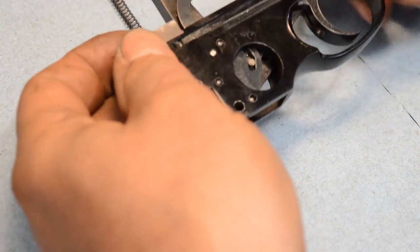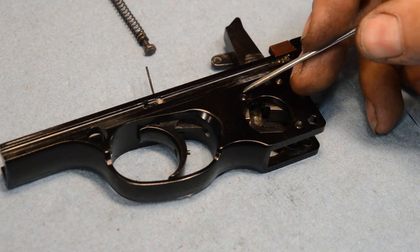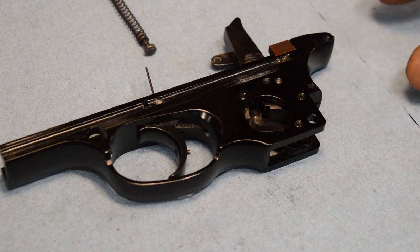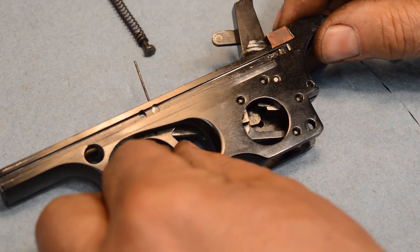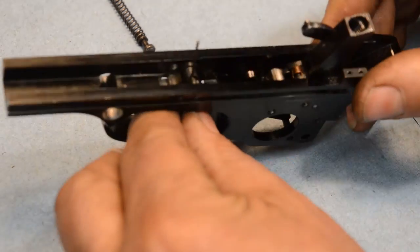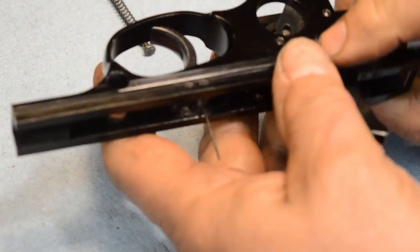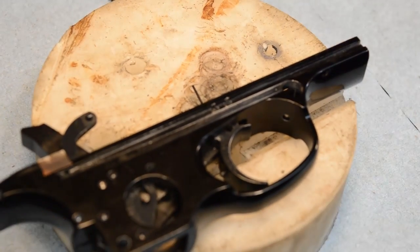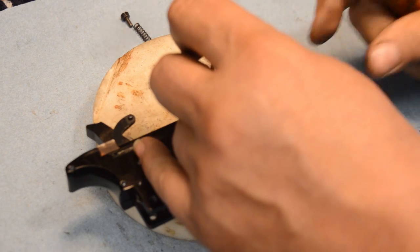How do you take this thing apart? The first thing is to get all the weight off all the springs. We'll pop this cassette out — I want to trap that and not go chasing it across the room. There is the main spring. Springs very rarely work without something on the other end: a screw on top and a plunger on the bottom — pretty standard. The next spring to get off is the trigger/disconnector spring. On the side of the disconnector there's a stud; shove down on this, bring it over, and that snaps the spring out of the way. That gets rid of a lot of the weight. This lower is made out of aluminum, so I don't want to mess this up.